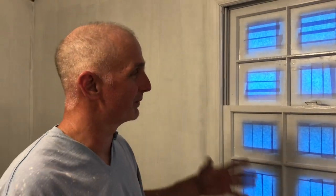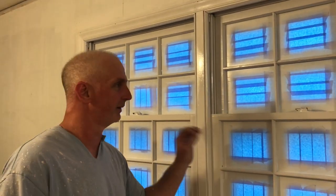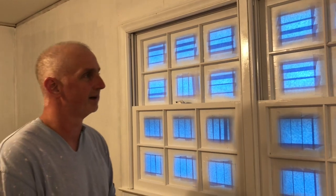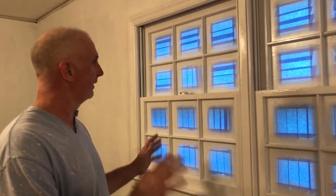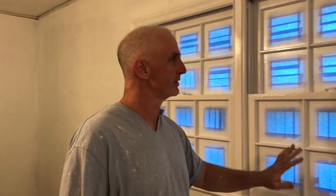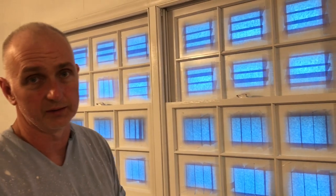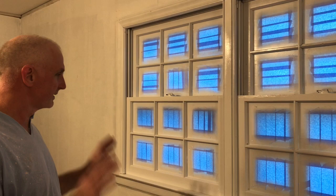All right guys, I got a smile on my face because this has turned out incredible. I'm very happy with this - we got a nice semi-gloss finish on here. I put two coats of the paint on there and we are done. We'll untape our windows tomorrow. This is the first time I've ever tried it, and the reason I did was because I knew I was dealing with a window that had stain on it and I didn't want to brush on one coat of Kilz and then come back with at least two coats of latex and hope I didn't have any bleed-through. This turned out phenomenal. There's not an excessive amount of build-up on it, so the windows should just pop right loose tomorrow - which is another thing you run into when you use latex paints to paint windows. You've got to be real careful around your edges or you'll end up taping your window shut. I don't think that should even be a problem.